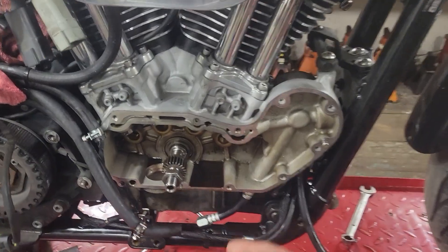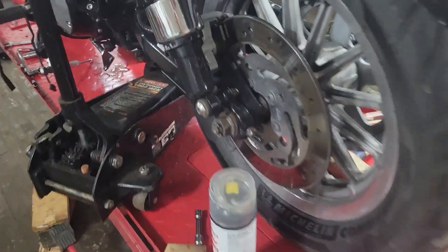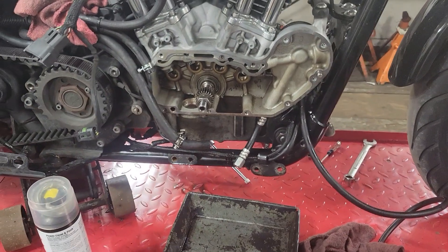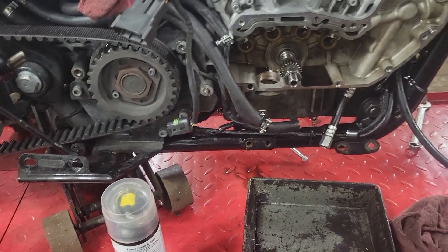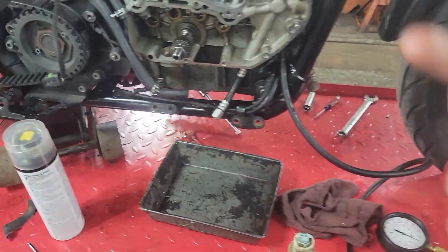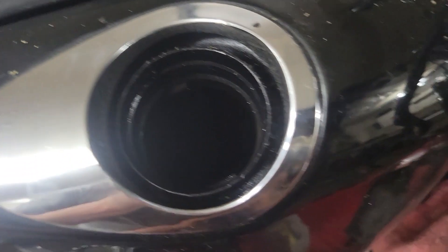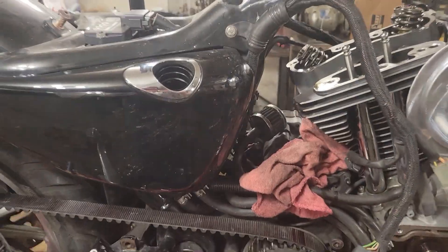The other thing I've got to figure out — I want to clean all these lines out. I'm going to use a can of AC Flush. The reason for that is it's a solvent kind of meant for cleaning compressor particulates out of your AC system. I think it'll be perfect, and it won't get in the motor because I'm just doing the lines. Then I'll spray them out with air and dump a little oil down them to bleed them. It should really clean the lines out. There's a little bit of particulates in there from when it was pushing bronze debris into the tank. I'm also going to check if there's anything in the tank — yeah, there's some debris in there.